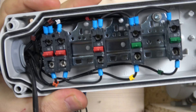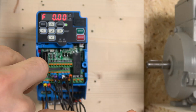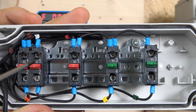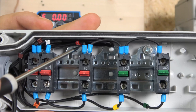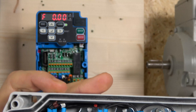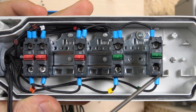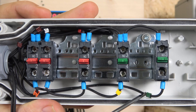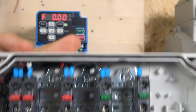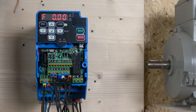For the three-wire wiring: as before, HC comes in and H1/H2 return to the terminals. V0 comes into a contact block, then goes to a normally closed stop button. The stop button sends power to digital input 2, and from there distributes power to two switches — the start switch on digital input 1, and the forward/reverse direction selection switch on digital input 5. You still have plenty of inputs left to add additional functions.